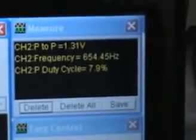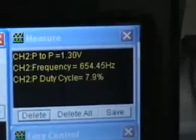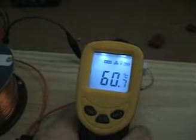We're now at 100 volts input. Our duty cycle is reduced to approximately 7.5%, flipping between values. Our bulb is at the same intensity — therefore we have the same amount of energy going into the circuit. But this time, the magnet is levitating off the surface of the coil. Let me poke at it — it's floating. Our temperature at the resistor is 60.7 degrees Celsius.